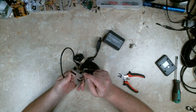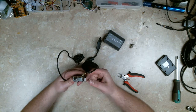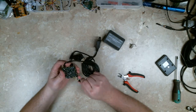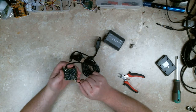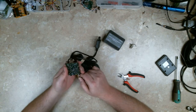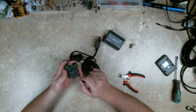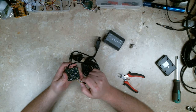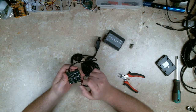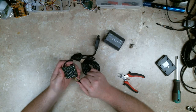It's actually made for a game. The stencil on this side says game. And it's a 4-pin connector with one of them marked as number 1. Huh. So, I need to know what these are, obviously. Clearly brown is ground. And yellow, traditionally, is video. And white is traditionally audio. And I'm going to guess that green must be power.